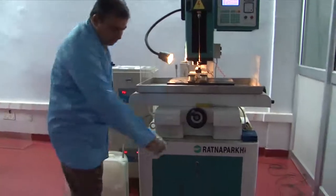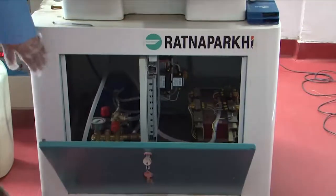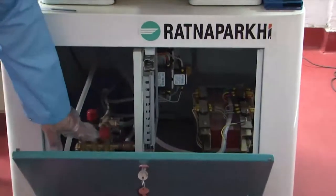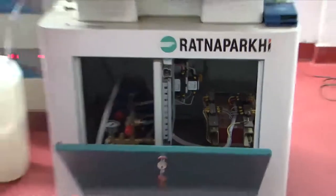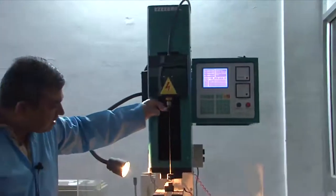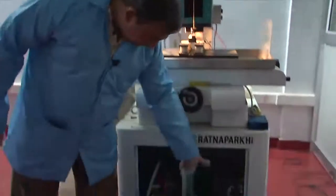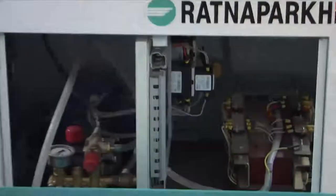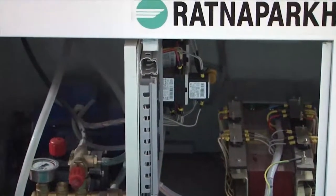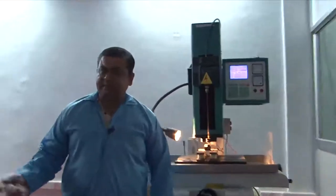Inside another box there is a pumping system that pumps the fluid all the way to the tool tip, dispensing it coaxially through the tube into the workpiece zone. There are also electrical parts such as a transformer that feed voltages into the system. EDM voltages can typically go very high, resulting in corona discharge of the electrode tip on the tool surface.